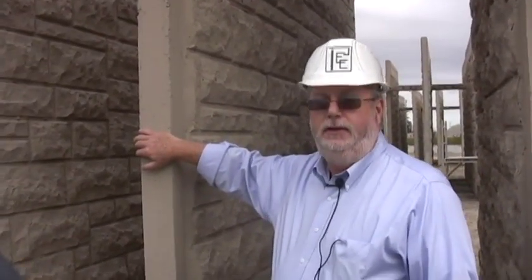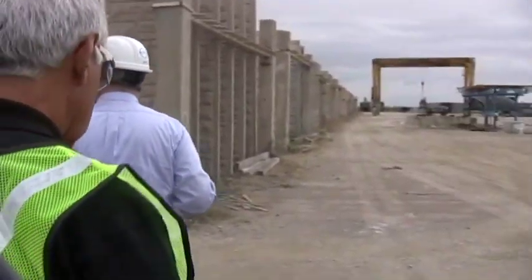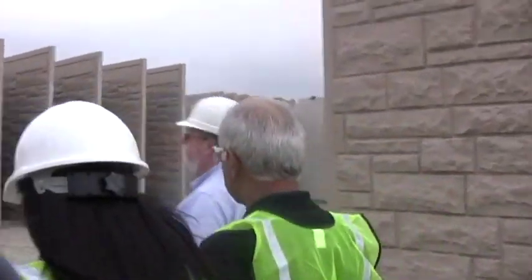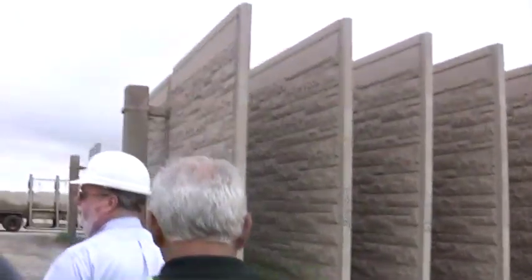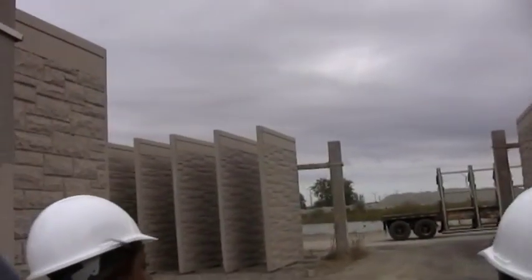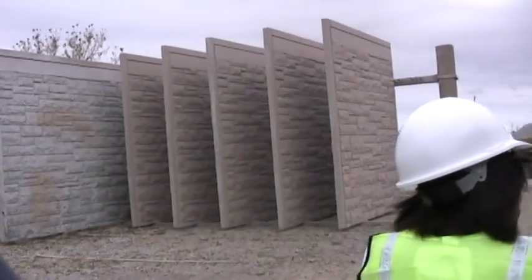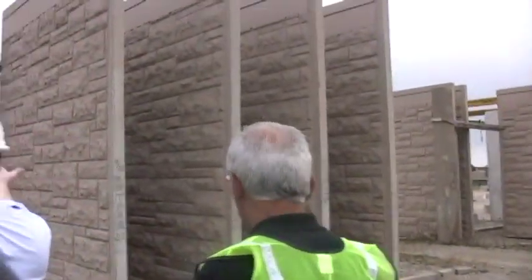The piece sits between steel beams — it's actually loose in that steel beam area. The steel beams are set in the ground first. If you ever see a job that has just started, the steel beam might be up ten feet in the air, but by code it has to be 80% of the height of the wall in the ground. So your beam is actually 18 feet, but you're only seeing ten. The reason for that is so the wall doesn't tip over.